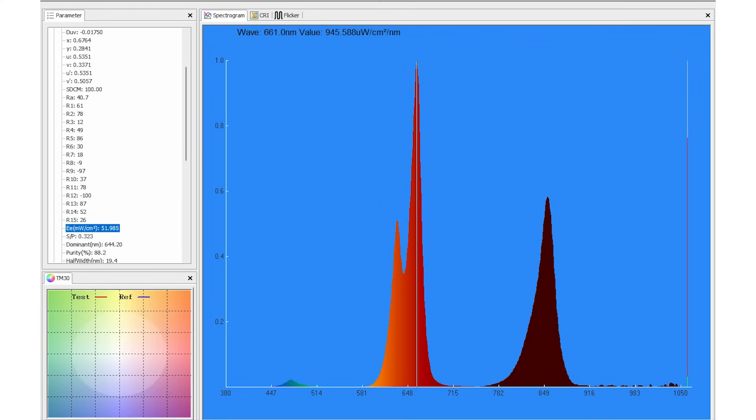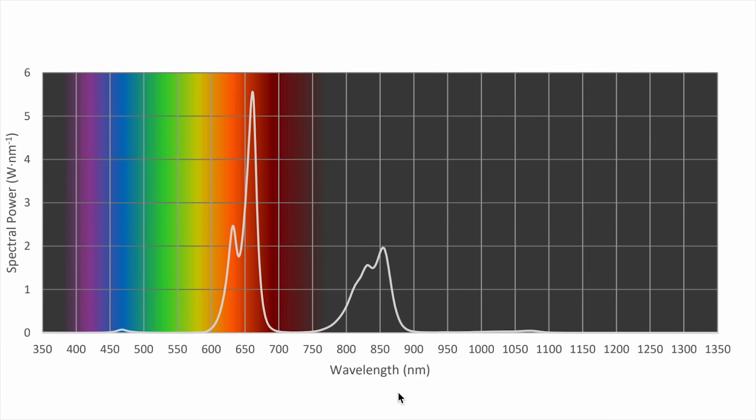On screen you can see the data from my spectrometer. We have a little bit of blue light in the 470 range, then we have the red peak at 630 and then 660. In this particular snapshot I see a lot of 850 — that is because most of the near infrared light is going to 850. As I move around the panel you start seeing more of the 830 and the 810 nanometer light. There's also a little bit of 1060 which I can't see with my spectrometer, however Platinum LED have had this panel tested by an independent lab and you can see the full breakdown of wavelengths in their report.